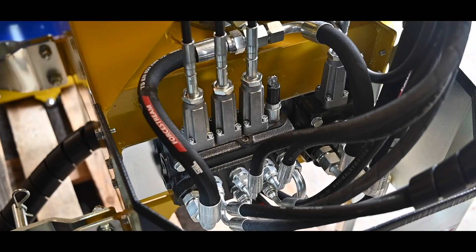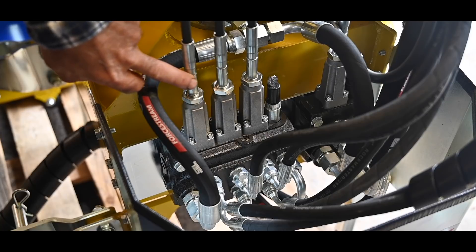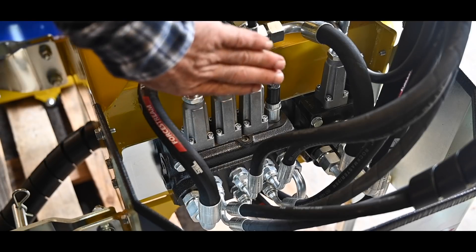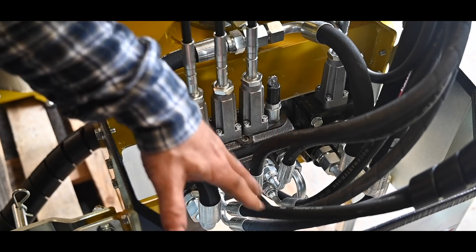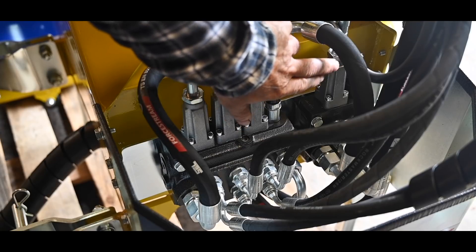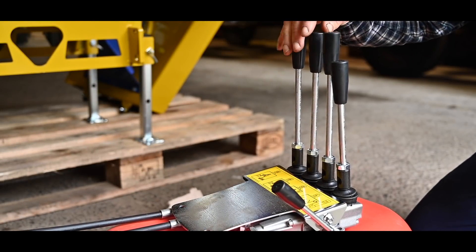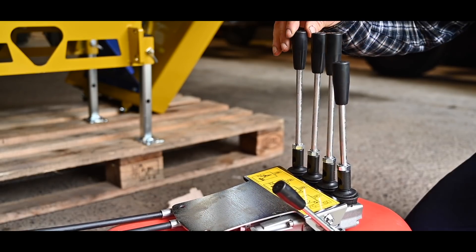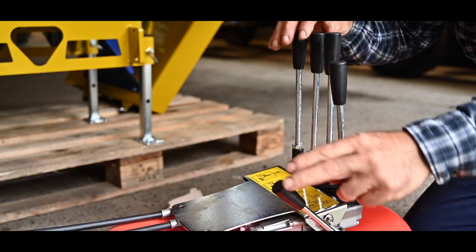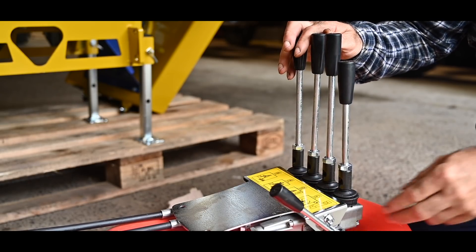The complete valve block controls the cylinders through handles and cables. You can also get an electronic system with a joystick — I don't have that because it's more expensive and I don't think it's necessary for how often I use it. These are the cables for the pistons, and on the bottom the hydraulic oil lines go to the cylinders. There's a second valve block on the right-hand side used to engage the blades on the deck. The control panel is fitted with levers — each lever controls a different cylinder (B, A, and D), plus a lever to engage the blades, and one to turn the blades left or right.